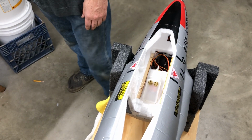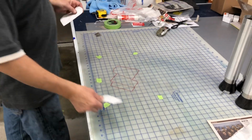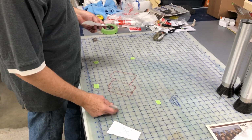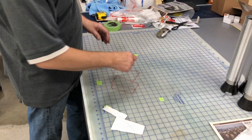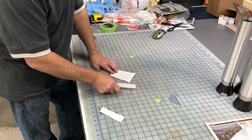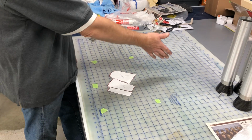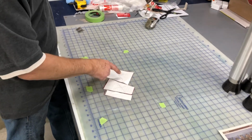Now we're going to wet out some fiberglass. So we're going to take our patterns. What I like to do is pre-impregnate the fiberglass, pick it up on a plastic sheet, and then just set it on my part, okay? What we got here is basically a clear plastic trash bag, like, I don't know, 2 mils thick. And I took a magic marker and drew around my patterns, okay? So the fiber orientation on my fiberglass is going to be running parallel with this grid here, and that's going to allow it to come out at a 45 on my parts.